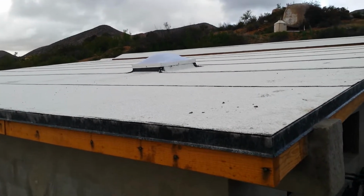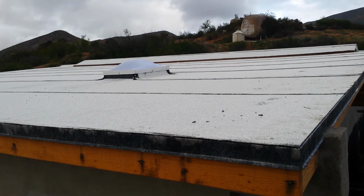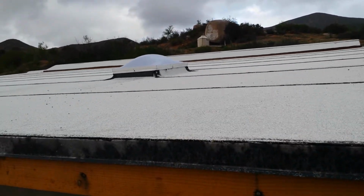And what'll happen is the wind is always coming. Right now it's coming from my back, so it's going up this roof and it's going through that vent there and out the other side. And what it'll do when it opens to the inside, let's see if you can see it here and if I can not fall in the backfill, but let's see if you can see up in there. Yeah, that's a 1-inch opening in between each rafter with a screen on it.